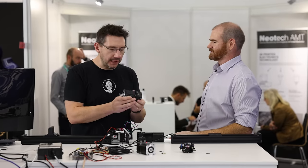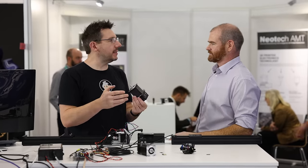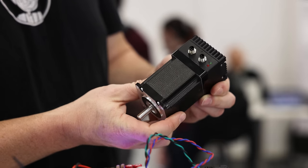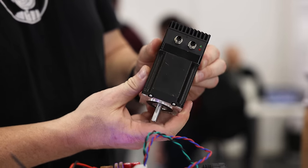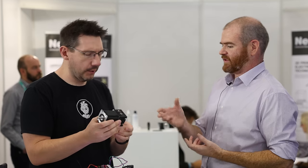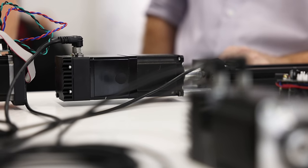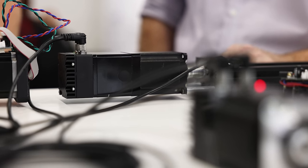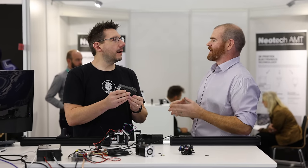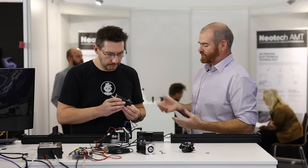These larger machines need larger motors, which is why the NEMA 23 is the right fit. This is a new launch — in production and starting to ship to the first customers next week. The key innovation is the tightness of integration: you just connect CAN FD bus and power to the motor and daisy chain them together, making wiring very quick and economical.